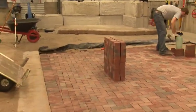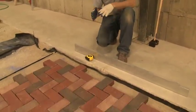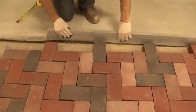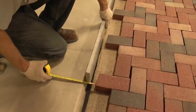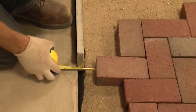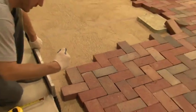In this case, we have purposely skewed the lane so we are able to demonstrate how to fix it. We noticed as we approached the garage slab that our bond lines were starting to shift in that direction. Just to verify that, we're going to take a measurement off of the garage slab using a straight edge. We get a measurement of 2.5 inches to the garage slab. If we go all the way down, we find that we're almost at 3 inches. What has happened is our bond lines have twisted in this direction and begin to sink that way.